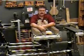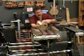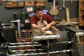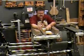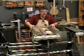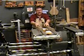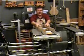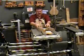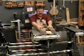We're going to pretend that this is a saw blade, and we're going to pretend that these are the teeth on the saw blade, even though they're not. I'm going to put one tooth back here. This is the tooth that's revolving up out of the table, and one tooth back here, and this is the tooth that's revolving down into the table. There's only two teeth on this saw blade. Very cheap. As you feed the wood past the teeth and then past the saw body, it cuts a kerf, and the space between these two pieces of wood is the kerf. And it goes back here, and then it has to pass back by the back tooth.